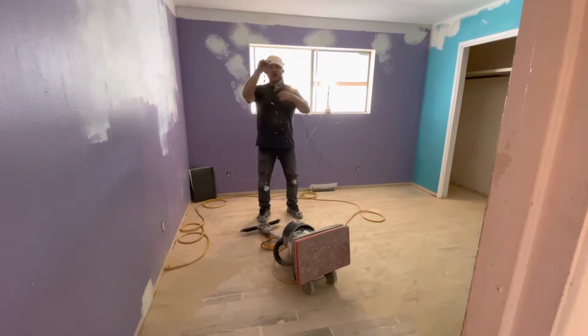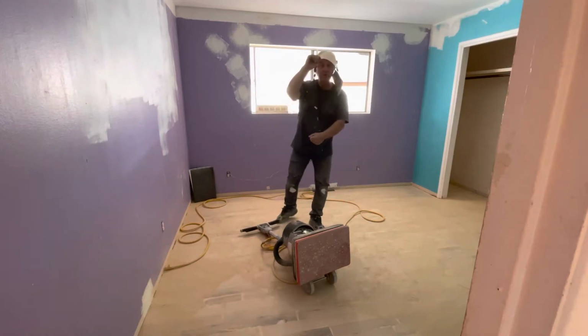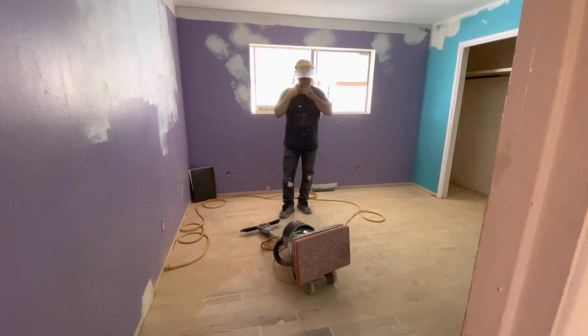And this is what you do after you nail your floor down. You're gonna fill it, trowel it in your wood filler, and then you're gonna sand. And you're gonna sand it all the way up to maybe 220, get it nice and smooth, get rid of all the scratch marks from the more abrasive sanding pads. And once you're done with all the prep work, to varnish this takes like 10 minutes. You know, all this is where the labor is.